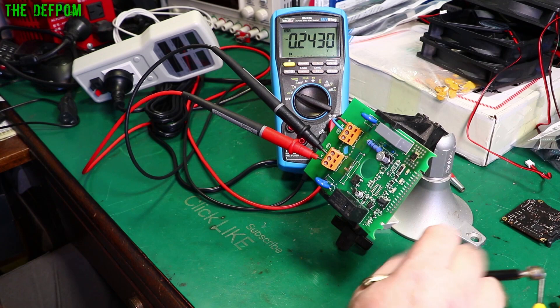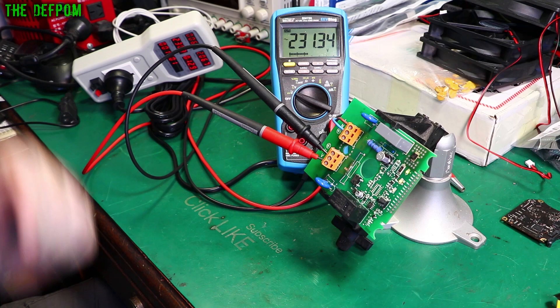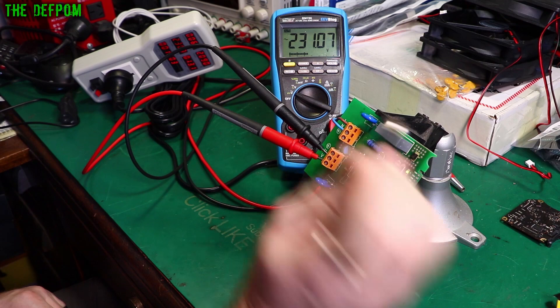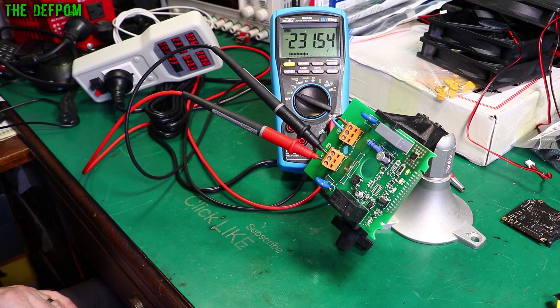I can see that switch moving. I'm going to use the magnets on these two switches and see if I can activate them by looking at the voltage coming out. This is not insulated so I have to make sure I don't touch anything with it as that could be potentially hazardous. Let's turn the power on. You can see it thinks it's on — output 230 volts. Let's put this near the switch... nothing. The yellow switch — nothing. So the reed switches don't appear to be doing anything. What I should do is actually probe across these and check for them switching.